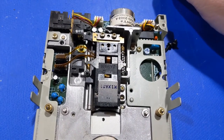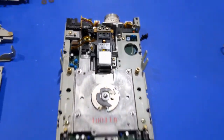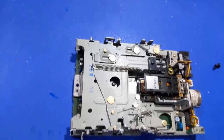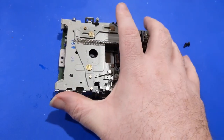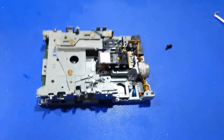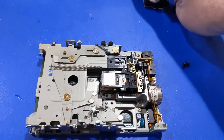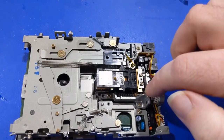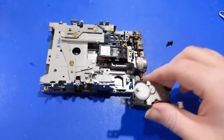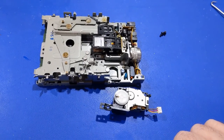Third tip of the day: do not touch this motor unless absolutely necessary. If you ever have a floppy drive that won't read disks you made for it on another machine — or vice versa — it means the track alignment is out. A heavy drop can knock it out. To fix it you must loosen and rotate the stepper motor to physically adjust where the head sits on the worm gear, and that requires a properly formatted disk and an oscilloscope on the test point to adjust for peak amplitude.